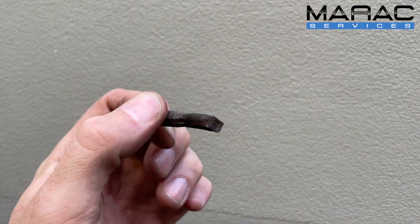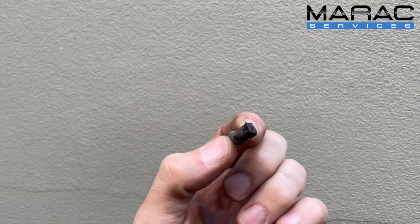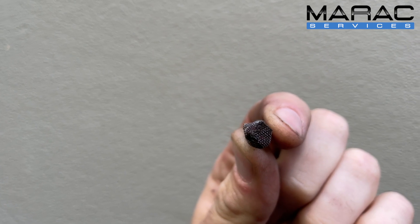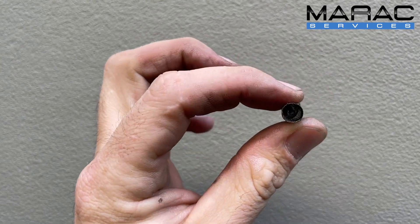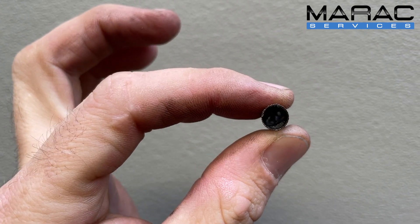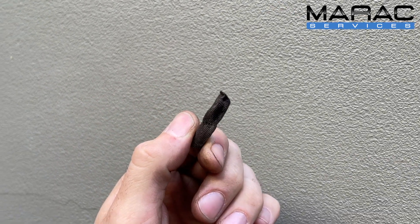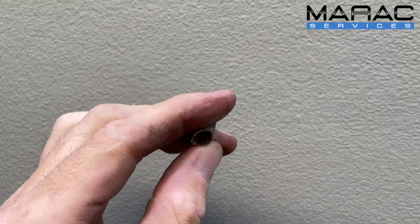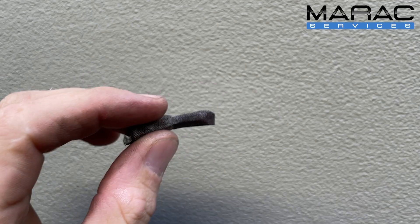So that's the strainer that I pulled out. As you can see, if that's in the pipe — it's a 3/8 pipe — that can definitely affect your pressures. So every time I've got an old system open, definitely check that. I've been caught out before.